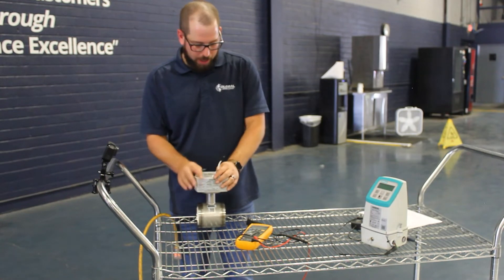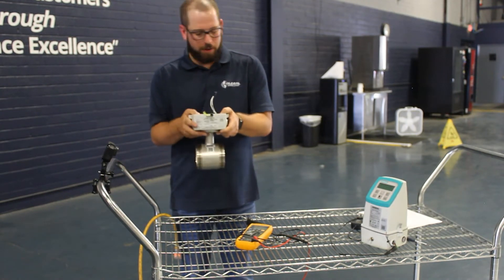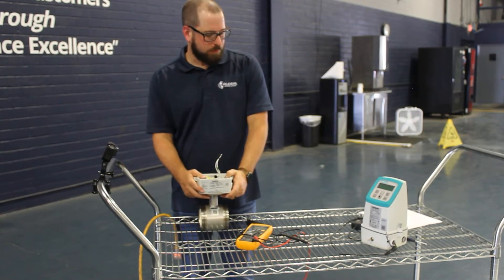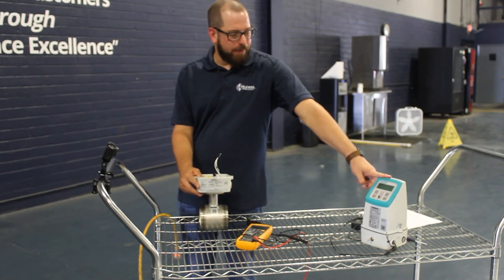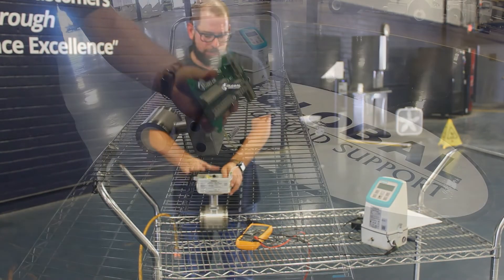That's a quick check. If the coil is bad and you need to order the MAG 1100 flow meter, the odds are your MAG 5000 transmitter head is still usable — just the base is bad.